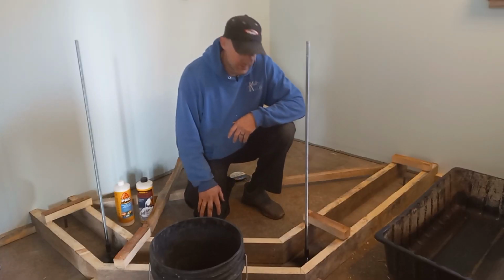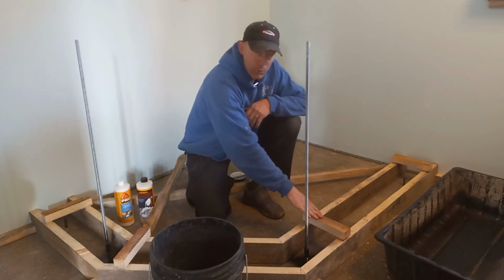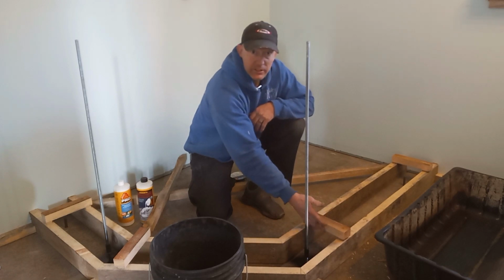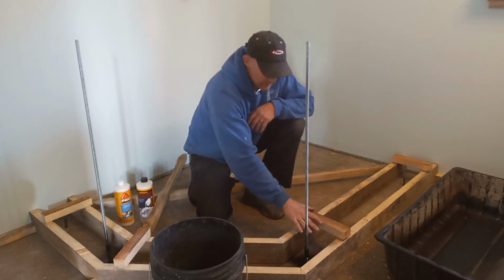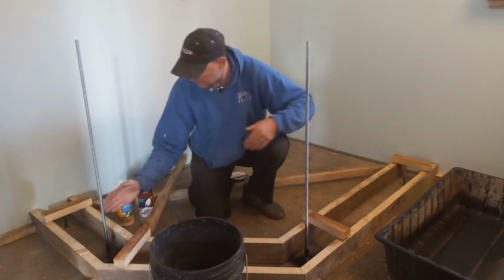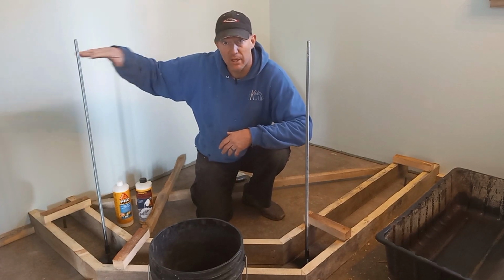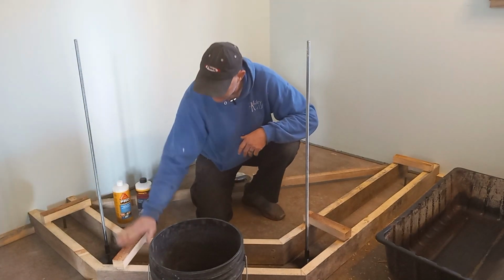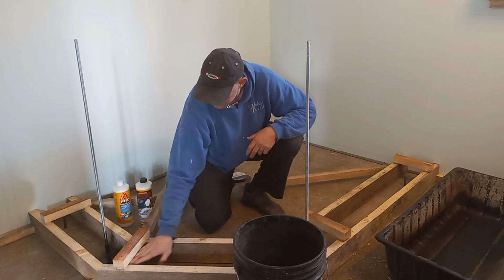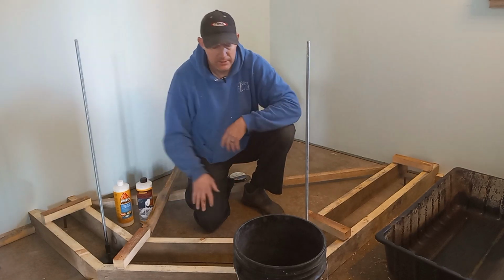The forms are done. I do have a little bit of a gap underneath here. So this support that holds it exactly 6 inches apart isn't sitting right on top of the concrete, and I can make sure and finish that concrete. It doesn't matter up to this point to the wall and from this point to the wall, because that's going to have another wall, a little half wall covering it. But this one in particular right here, I wanted to be able to finish underneath it, make it nice and smooth, because that's the entrance to the walk-in shower.